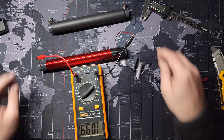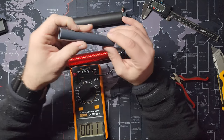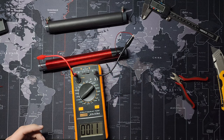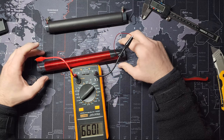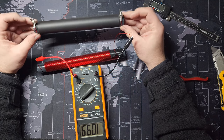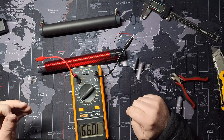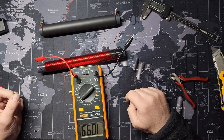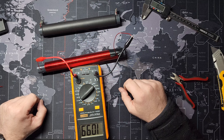I want to make a QRP version of this. I've got this 25 millimeter outer diameter PVC pipe, and I also have a 20 millimeter one - I think that's the size I'll need. I might make it another video, either added onto this one or a completely separate one for a QRP radio. It hit 110 microhenrys - I've got to tighten it up a little bit. I'm going to put heat shrink tubing over it, heat it up off camera, and get the hardware on there. I'll show you how to do that. I also plan to do another video showing SWR readings through my FT-991 on the current antenna, and then after the coil to see if I can get some 80 meter contacts.